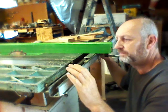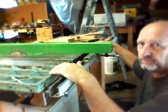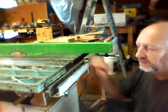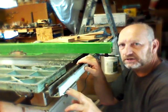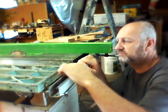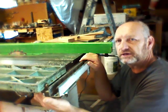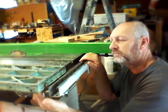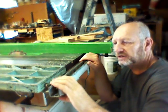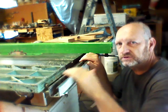Basically what I did is I got a piece that extends past the tabletop of my saw so that I have more cutting capacity. I got an L bracket here — I took the old fence off and there are different sets of holes in the end of my table saw. I took an L bracket, bolted it to the table saw so it extends out, and then I bolted this Unistrut railing right to this L bracket to hold it here.